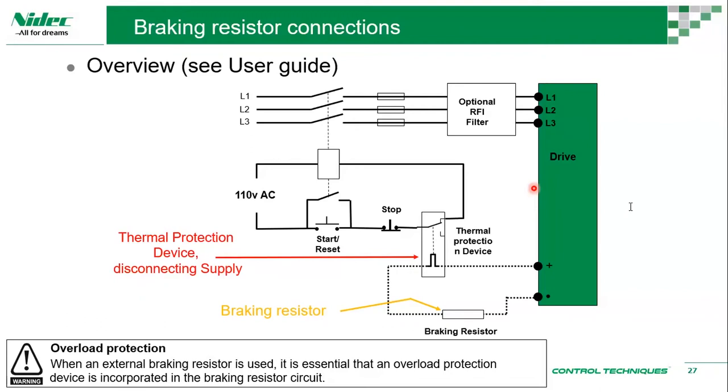They run on electricity, so they have bare wires and connections. These connections should not be affected by dust. But when we say dust, it can be carbon-based dust, it could be electrically conductive dust, it could be just random. It may not affect them, but it can also accumulate and heat up the component. So we try to isolate the components from the environment. When the dust is on top of it, the only issue we're going to have is heat dissipation and not any shorts or stuff like that.